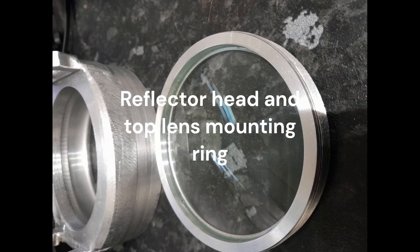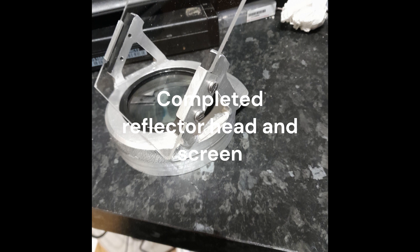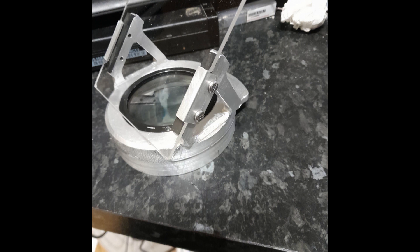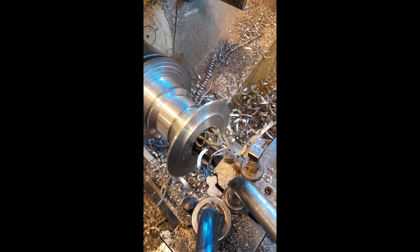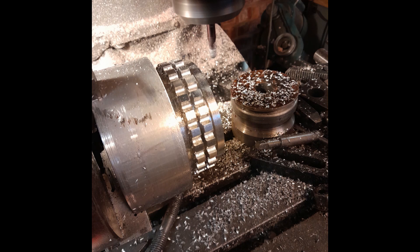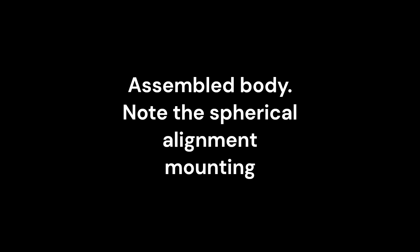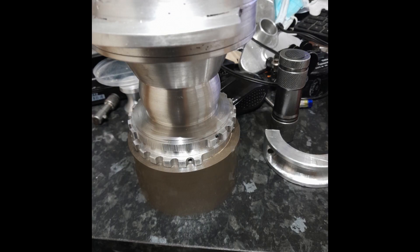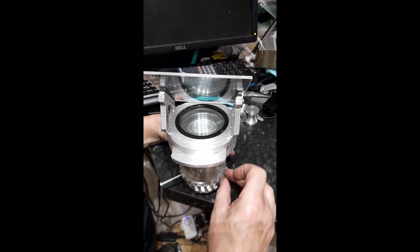The gun sight consists of three main sections: the reflector head casting that houses the upper focus lens and bezel, the reflector screen held by the angled arms of the casting, and the main body which houses the sight graticule and the adjuster cams. The cams are operated by two rotating rings — the first sets the base length for a particular aircraft wingspan such as an ME109 or a Heinkel 111, and the second ring sets the range scale. While sophisticated for its day, the Mark II sight was soon superseded by the gyro-stabilized gun sight.